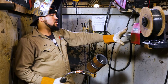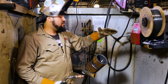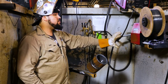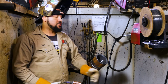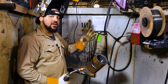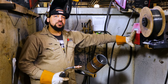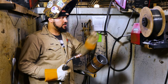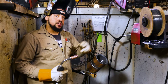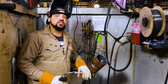Now that we've switched our wire over to flux core, we're ready to start our filling cap. We've swapped everything over because we're done with the MIG root, so now we're using the flux core wire for the filling cap. The number one important thing: make sure you turn your rollers to the correct size. Since the flux core is 045 wire, we have to swap our rollers and change our contact tip. Now we are ready to start welding our filling cap on our 6G pipe.